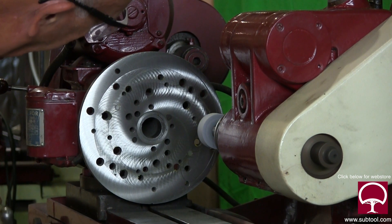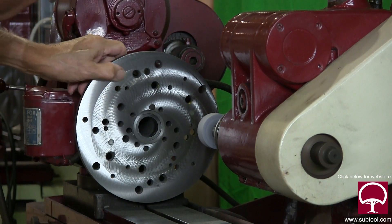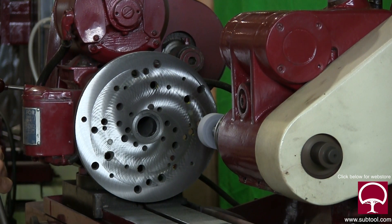That's the secret to grinding a faceplate - it looks pretty good. I don't feel a step in there, and it's got a cool look too. That's how we make sure the faceplate is flat, square, and parallel the way it should be. We ground the faceplate and I'm very happy with that - it should run within a few tenths as mentioned. In our next video, we're going to mount an adapter because we need to mount a chuck on there.